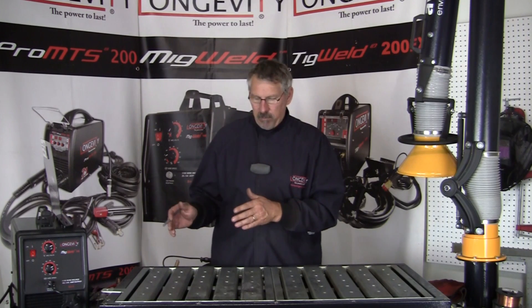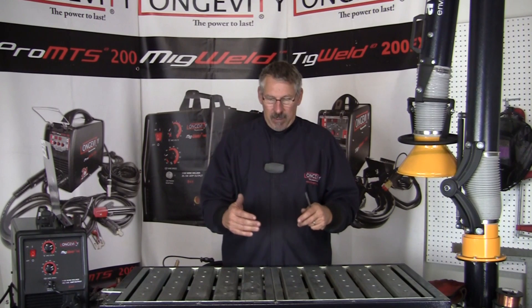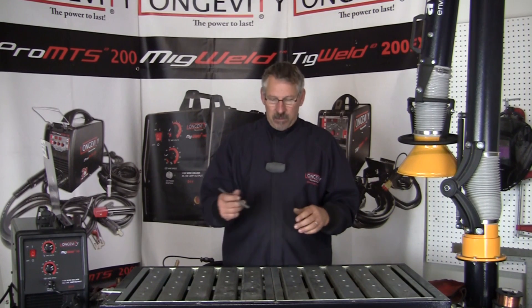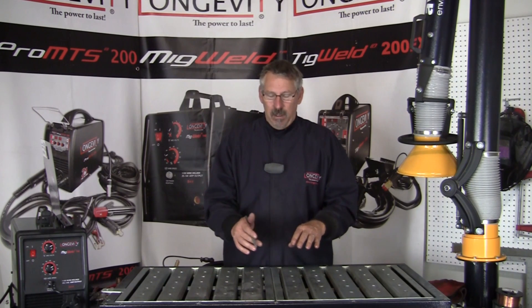The same machine is performing both welds — it's feeding wire through the torch to the workpiece. Where the processes start to change is in how the weld itself is protected. Flux core: flux in the wire, doesn't need any shielding gas — the flux is protecting the weld, so you can weld in wind, rain, whatever conditions. MIG welding: you're supplying gas from the bottle, through the machine, through the torch, and the gas flows out the end of the hose to shield the molten metal from oxygen and nitrogen. So the protection of the weld itself is the big difference between the two processes.